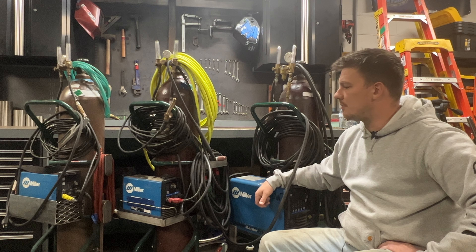So this here is the bench rig. We set it up in the work area — it usually doesn't go very far. It's a little lighter duty because we're typically not welding structural at the bench, a lot of sanitary tubing. This is the Miller Maxstar 161STH. I do have high frequency capabilities — if I need to do some precision welding, I can plug in the foot pedal and use it — but for the most part we're just running lift arc. We've got the four gauge ground lead, it's only 25 feet long, not going too far from the bench. The torch lead is also 25 feet long.